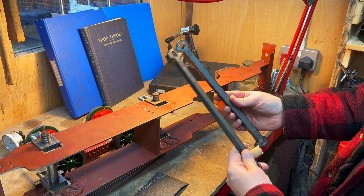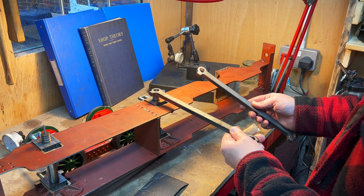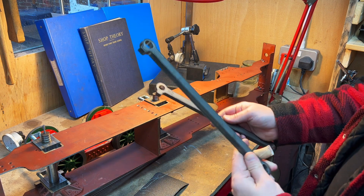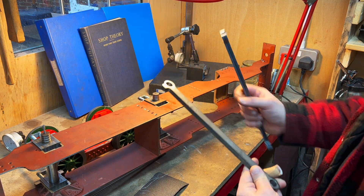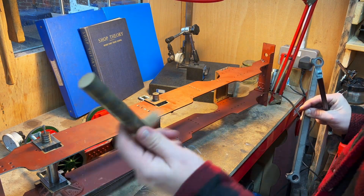So there are the rods. Hopefully these centres are still matching over here. I won't be able to tell because these are now 9/16ths and the pins on the wheels are 7/16ths — that's because I need to turn some bushes out of bronze.